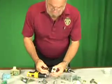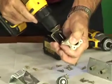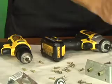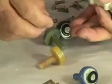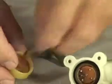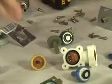This valve here has been in severe corrosion. You can see the internal screen is completely rusted. Let's see what effects this has had on the solenoid valve's operation. Removing the coil and the valve seat, you can see the internal valve is completely rusted. This would affect the ability of the valve to open and close, and the internal valve is also full of corrosion. On this particular valve, the material that's designed to stop the flow on this end, neoprene rubber, is not making contact. Again, it may on one and not on another. So these are all signs of intermittent failures.